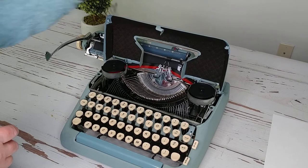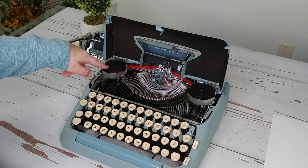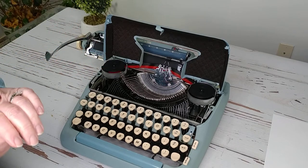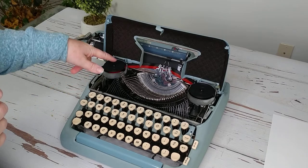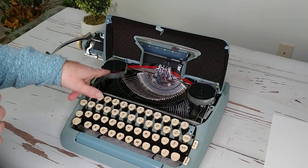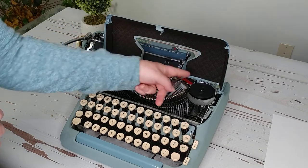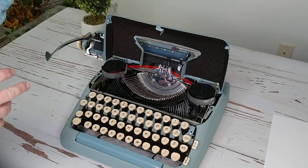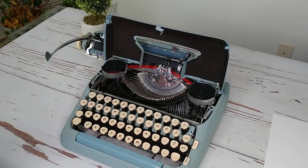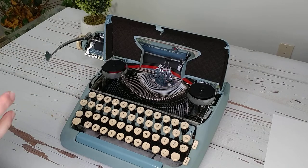To look inside your typewriter at the ribbon, please make sure you move your carriage to the left, then pop it open and you'll see the ribbon spools. This takes a universal ribbon, which is available on our Etsy shop. The black goes on top and red goes on the bottom. Please be careful threading it through — sometimes when we ship typewriters the spools pop out and the ribbon gets out of the guide wires. The first thing you should do when a typewriter arrives by mail is check your ribbon and make sure it's threaded correctly.